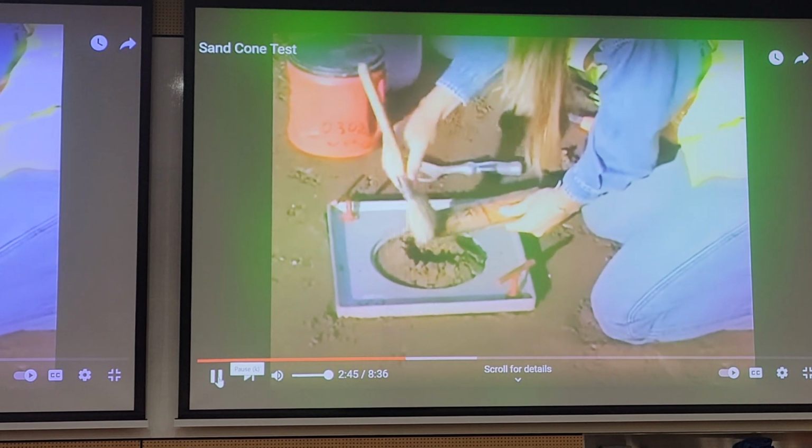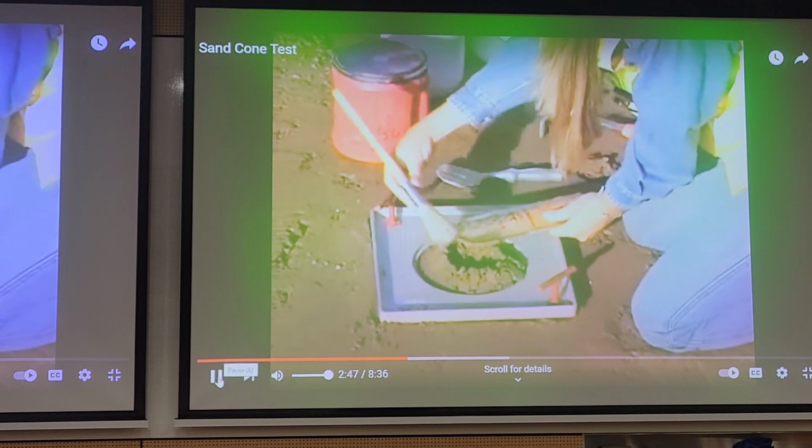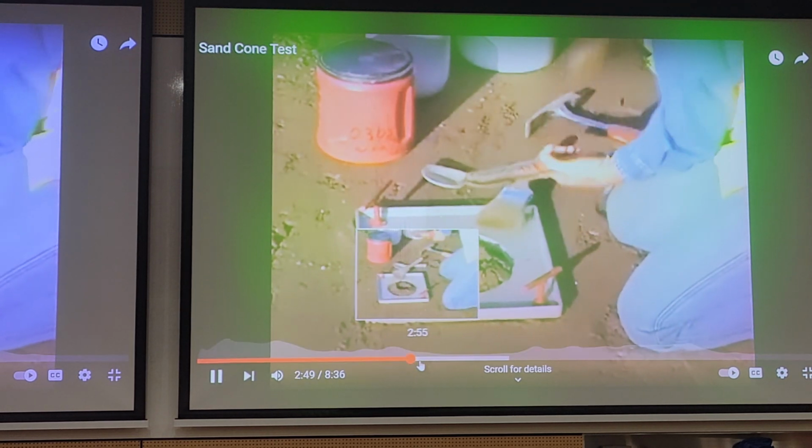Caution should be taken when removing the soil from the test. So notice how he's very careful about not losing any soil. So this is probably easy to do for silty sand, but it's less easy to do if you have a lot of clay stuck to the blade, or you have very coarse ground material and it just drops everywhere. So that none of the material is lost.